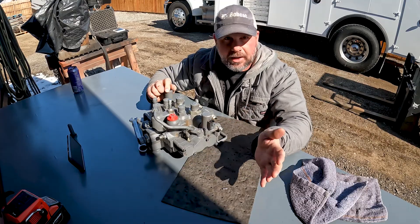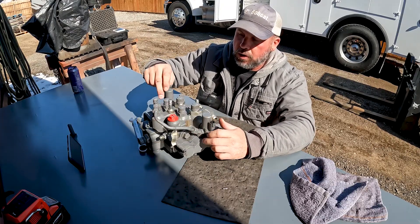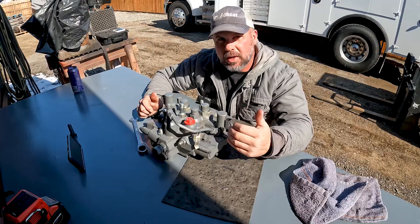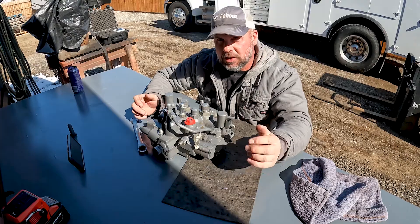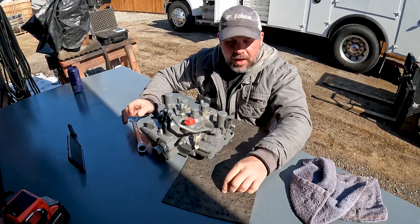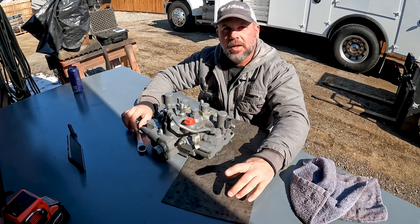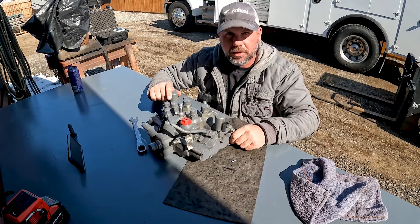Just take those guts out and we'll never have another problem with charge flow into our BICS circuit, brake coil, or two-speed. Everything will work like normal. You may or may not run across this issue, but if you ever do or know someone who has, now you know what to tell them. When you start the machine and press the green push-to-operate button, the tracks don't release and you don't have hydraulics right away — but usually after a few seconds, oil squeezes past the poppet and builds enough pressure to get you up and operating. Any questions, let me know. Thanks for watching, and thank you for the comment — hopefully we can help someone else down the road.